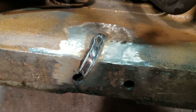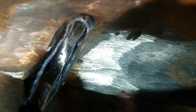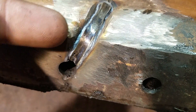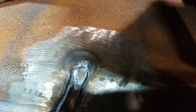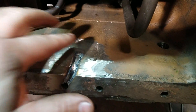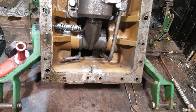I already ground this out a little bit. Let's see how close it will go — you can see it's still porous, a lot of bubbles coming up. He said he could feel it. I think it did get some fusion over here on this side, but I'm going to try and fill it in with this nickel rod. I can always just keep grinding it out. And if I crack the whole thing even worse, I still have that other housing and I can convert to Category 3.